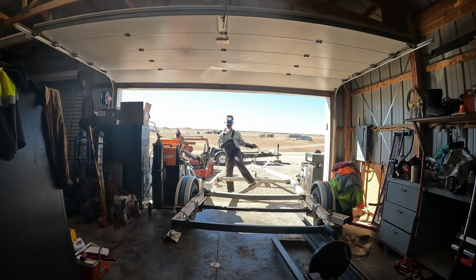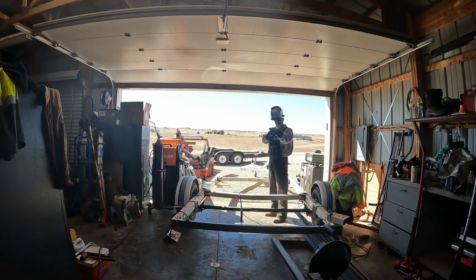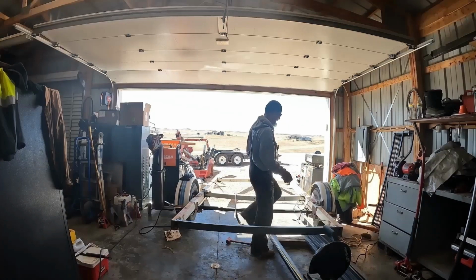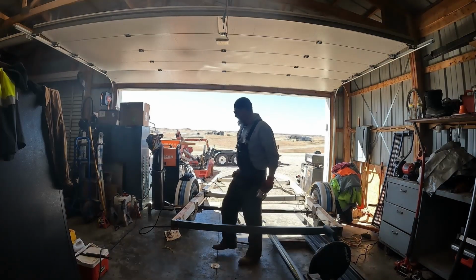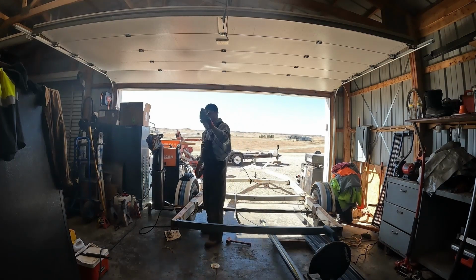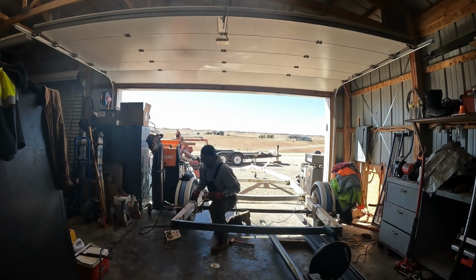One thing I gotta do is pull that whole piece off the tongue because it's not fitting right, because everything's bolted. I'll re-weld it level with the rest of the frame. I'm using a wire wheel because I don't want there to be a lot of sparks because of the wind. The welding's gonna be putting out enough sparks.